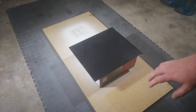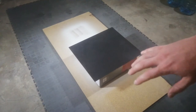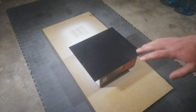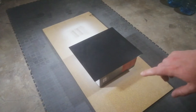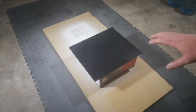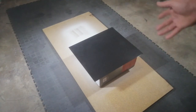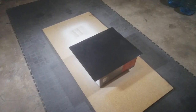Okay, so now I've got the side panel here, and I've just prepared it for painting. What you want to do with large panels especially is to get every single piece of particle off, that's dust or whatever may be on the panel, because you will see that in the end product. And that's the mistake a lot of people make, is not getting all of the dust off, sand or anything that the wind may blow onto it. That's why it's important to actually paint inside rather, if you can. Otherwise, a very quiet day where the wind's not blowing should be fine. But there's always going to be something that lands in your paint or before you spray it or on your paint. Anyway, here's to hoping there's no dust on the actual panel. And here we go.